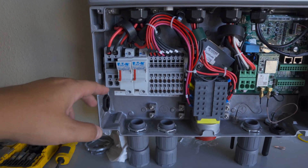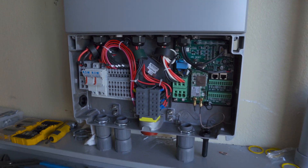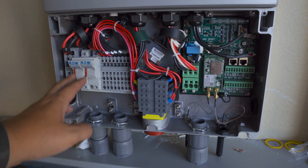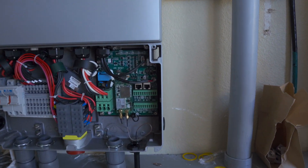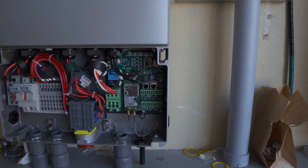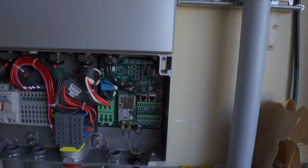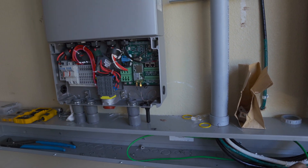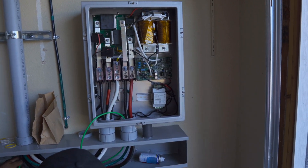What's interesting to note is this is actually a DC input on the Delta Inverter. You can also tie in an LG Chem battery. So you could have a solar input, your EV charger input, and an LG Chem battery all wired into this unit - three sources for emergency backup. There is a black start feature built in, which means when there's a grid outage and you drain the battery completely, the system has a backup battery to keep the communication board online and ping for solar production in the mornings. Not a lot of products have it, but quite a few battery systems have started to deploy black start features.